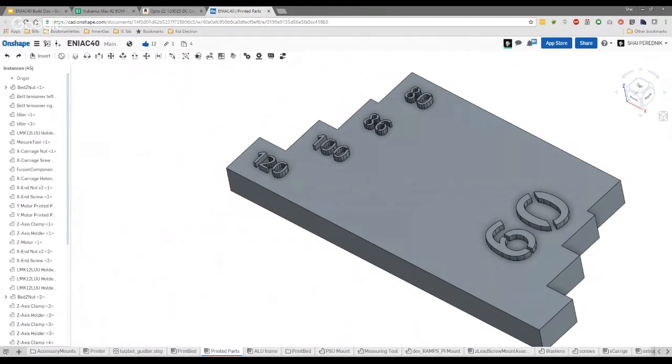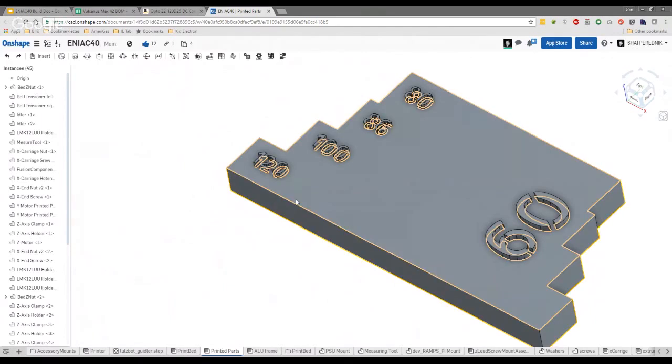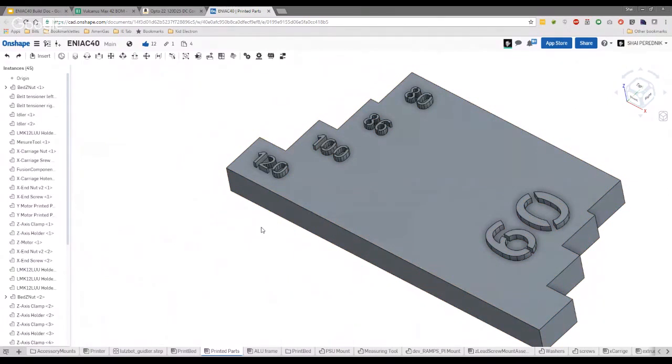And then the drawings, hopefully, that we'll publish as PDFs and attach to this, will help people follow along exactly where it's spaced, 80 and 86. Yeah, exactly. And just to be clear too, I think they're rough numbers. They get you very close, but you might find that you have to move something just a tad over because of binding, because your rod's not exactly right. So I used them all to these numbers, and then I slightly nudged them over a millimeter or two sometimes just to get rid of that binding. Sometimes it was just a case of undoing the bolts and tightening them back up again to get rid of the binding, because it would move where it naturally needed to move. But that's your guide to start with.